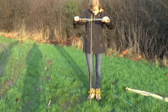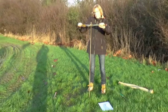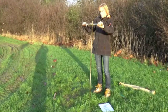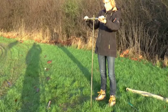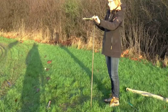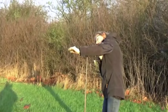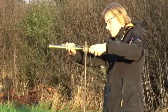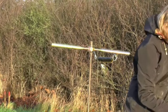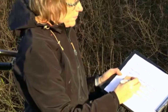The first measurement is for the undisturbed strength. It has to take about two minutes to find the maximum value, so you go very, very slowly. You can feel when you have hit the maximum value, and when you have reached that after approximately two minutes, you read the scale. Write it down in your table: at 0.2 meters, write the number from the scale in kilograms — that was six.